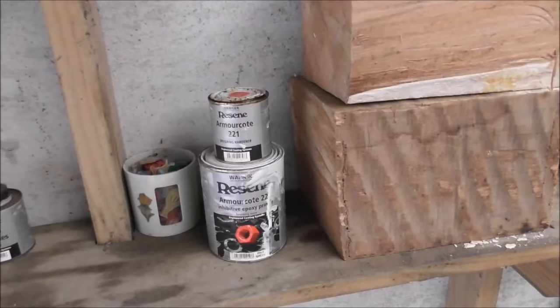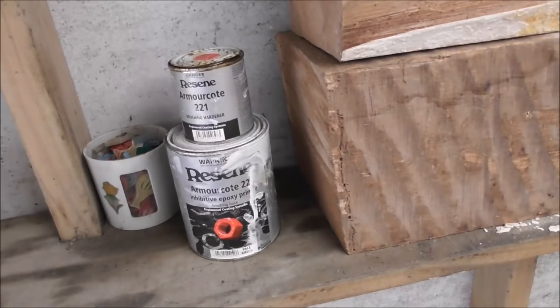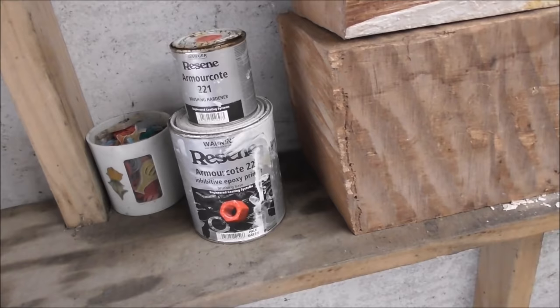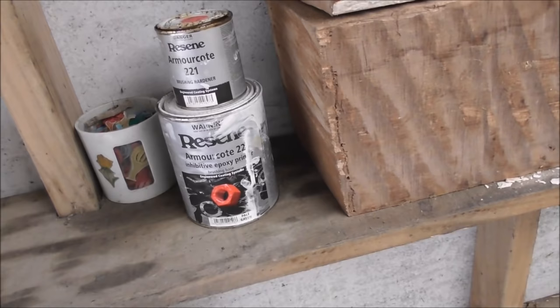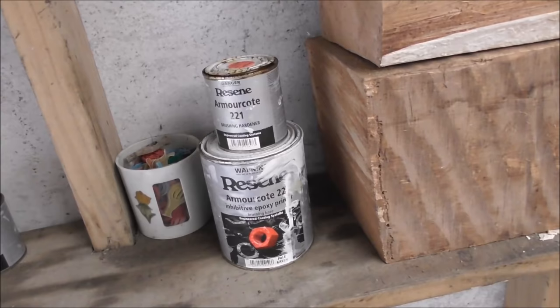There you go. In the past, I've used aerosol paint, an aerosol etching primer and an aerosol enamel for a top coat, and it's great. It's quick and cheap, and it does a great job. You just hang it up with some wires and spray away, and you're all done in half an hour. But the trouble is that in the long term, coolant and lubricating oils turn it into a treacly gunge after a while, especially if you're brushing it with chips and swarf. So I've slowly moved away from that now.